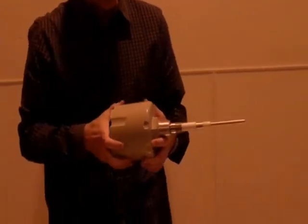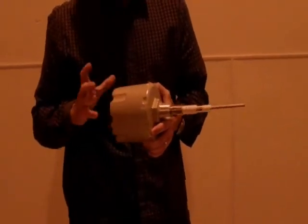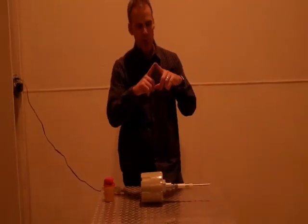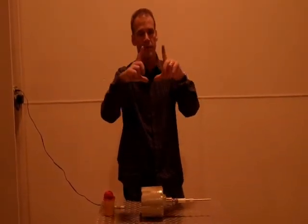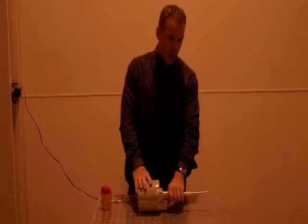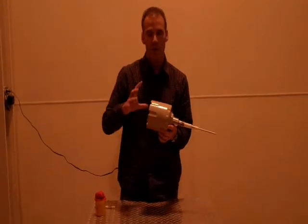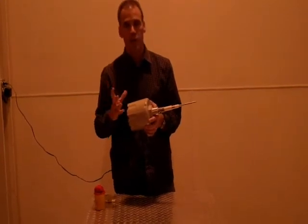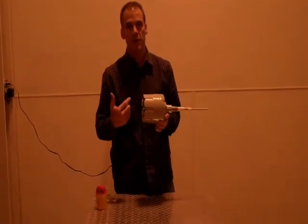It's only when we touch the probe that we're going to get a signal. The reason why we have miscalibration problems is that most units are actually made of Wheatstone bridge technology. With a Wheatstone bridge — like that used in load cells — this leg and this leg have to be in balance, and this leg and this leg have to be in balance. The problem is you have a probe made out of stainless steel, but the Wheatstone bridge is made out of an alloy, so when you get more than a 30 degree temperature change, you'll lose calibration. Another issue is RF interference, where other radio frequencies can absolutely reset these units.